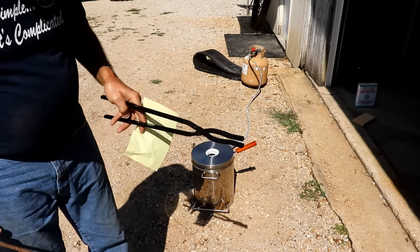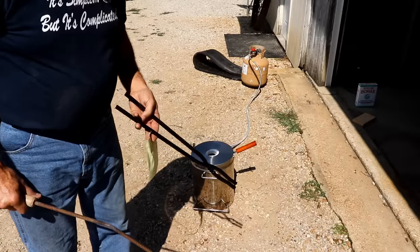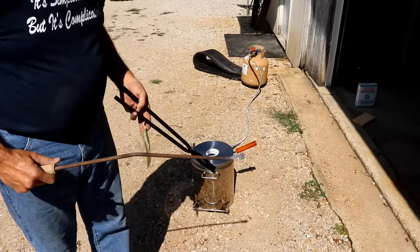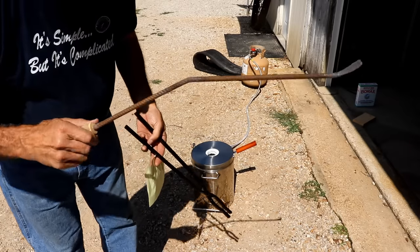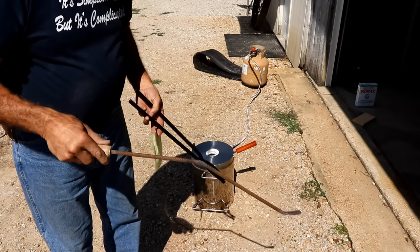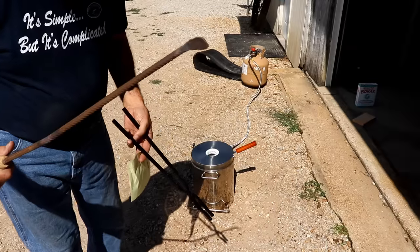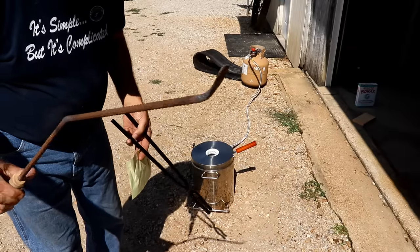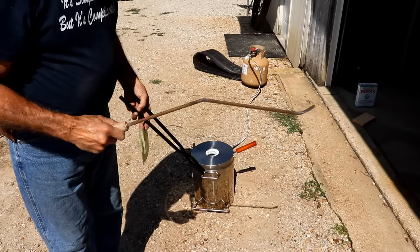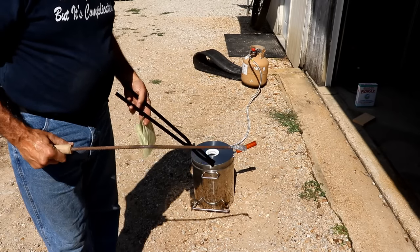These are not bad. I mean, they're quarter inch steel and stuff. They're pretty stout, but I think we could do better if we had a little better setup for the pouring and everything. And then the only other thing I made was this little wand, a kind of stir stick where I can go in and clean off the dross. It's just a piece of rebar that I flattened the end out on, and I think this will help me get rid of the dross. That's the only thing I've made in addition to what came in the package.